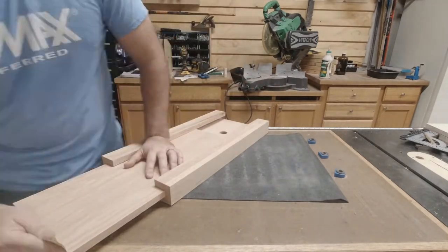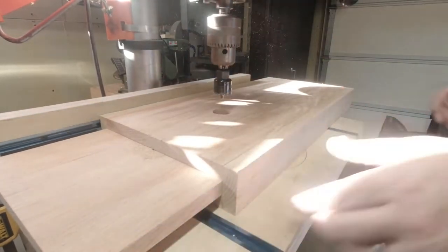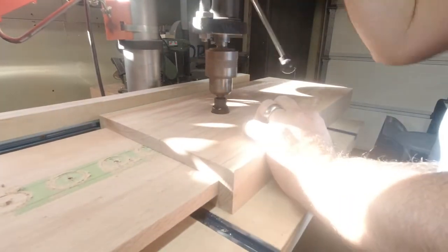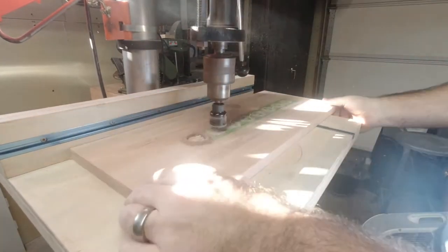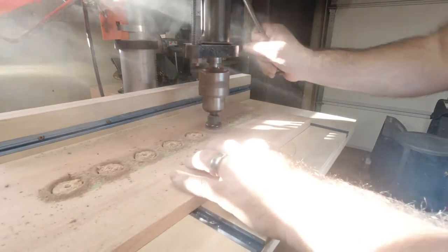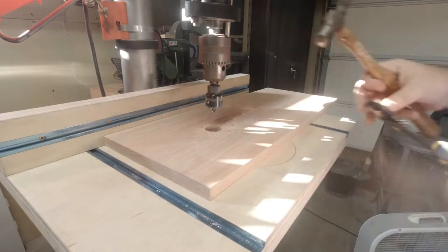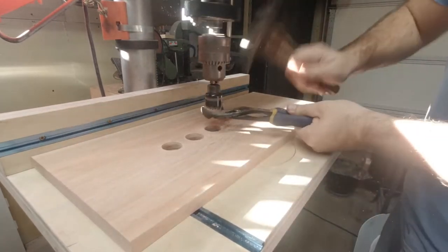It slides pretty good. That hole I drilled is used as a guide — this will be the hole that the dowel runs through. There are several holes on the inside board that the dowel goes through to adjust the height of the table. I'm scoring the surface so I know where the holes are supposed to be, then I'll remove it from the sleeve and drill partway through so the pilot hole punches out the bottom — I don't want the hole saw going all the way through, just the pilot hole. Then I flip it over and use the pilot hole as a guide, coming through the other way until the plug comes out. This reduces tear-out and makes it much easier to get the plug out of the hole saw.